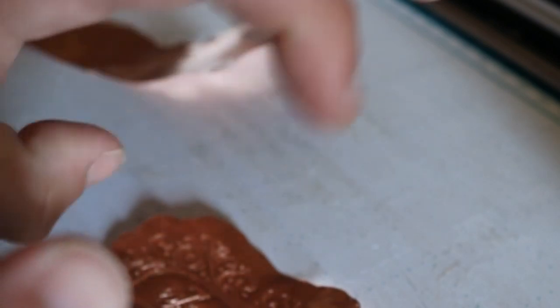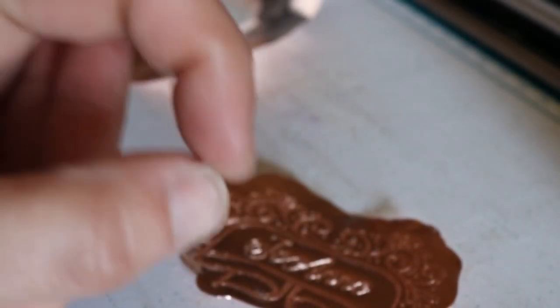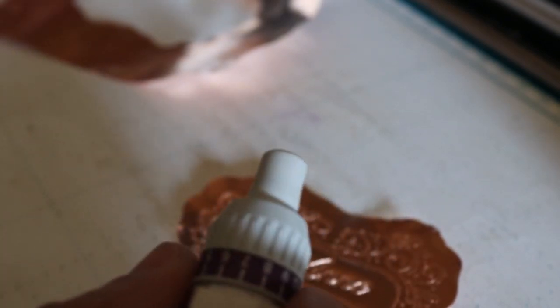Okay, if you set that blade too deep, you'll hear that cracking, but more than likely it's going to take off and make its own path. Okay, or it's going to spin that metal and wreak havoc in your machine, all right? Metal can often take tons of different cuts where you just set that blade ever so slightly deeper each time, okay? When you take a knife and you try to cut through any type of metal, it's really difficult to do, all right? But it is possible. You just have to take time and great patience. All right.